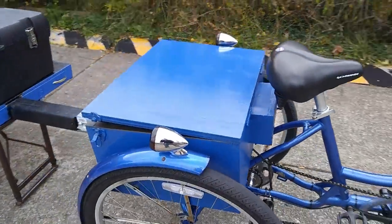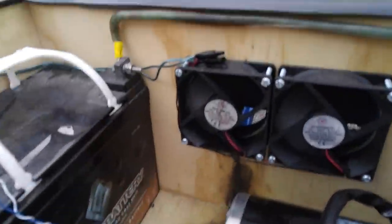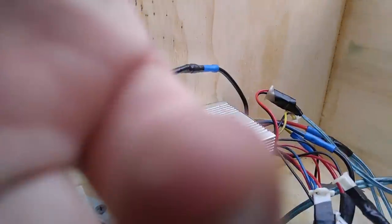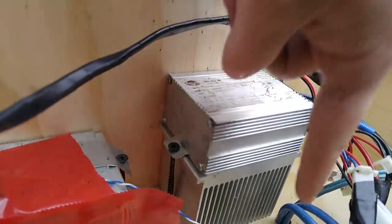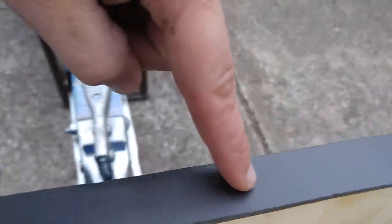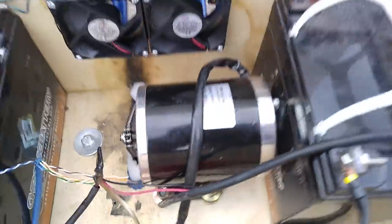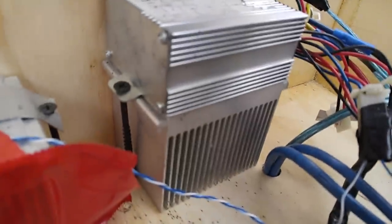The box has been rebuilt larger. We finally have our cooling fans installed — they move a heck of a lot of air. There's the heat sinks; one is blocked off because there's nothing on top of it. We have our controller box sitting on top of a heat sink with gold heat paste in between to allow for heat dissipation. All the way around the edge there's sealed foam tape, and right around the chain drive there's foam so the chains stay sealed in. When I close the lid, all the air that these fans draw in gets pulled past that heat sink to keep the controller box cool.